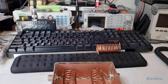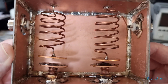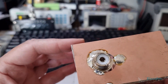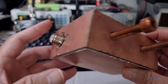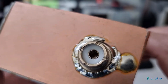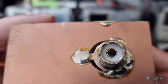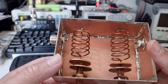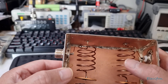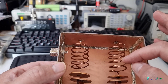Hello everybody and welcome back to my vlog. Today I'm going to show you this. Now this looks a bit Frankenstein-y, and it is a little bit Frankenstein-y. It goes to show that even without the right hole cutter sizes, I'm just using what I've got. On that side I've only got a 20mm hole cutter and really I needed 19mm. I only had the mains cable — 30 amp mains cable — and that's what this is. It's not really what I want to be using.